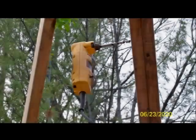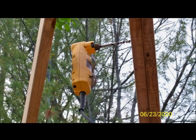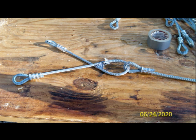It was time to drill the holes in the double rafters. However, the space between the double and cripple rafters was too tight for a regular drill. Fortunately, I had an angle drill that I'd bought for $25 years ago at a garage sale. I used an auger bit to drill the holes — an auger bit is way faster than using a spade or high speed bit for going through wood. Now it was time to raise the harness to its final position. This part would be connected to the double rafter, but because the cable was springy and tended to want to be straight, I used duct tape to hold it to the correct position.